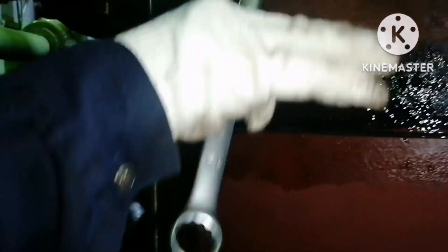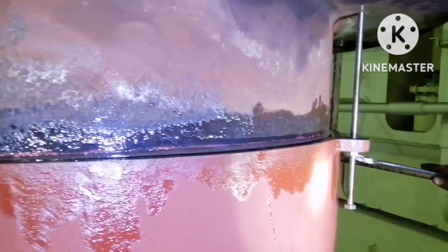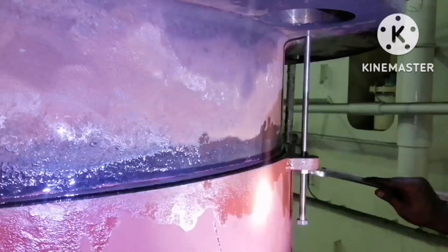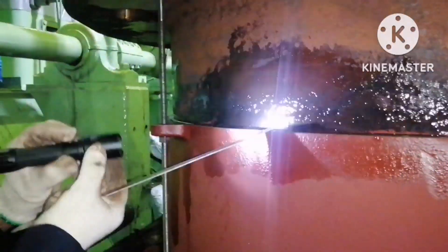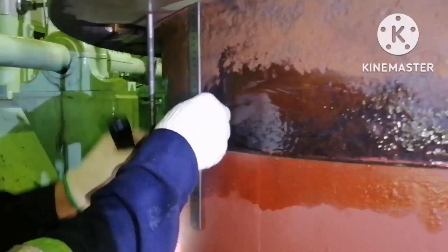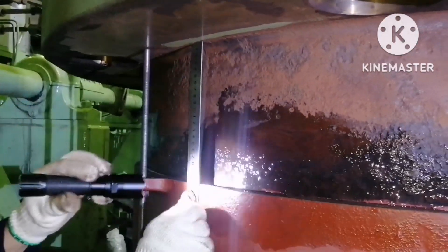The jacket is touching the top portion. This is a very critical stage because the o-ring should not get damaged while we are fitting the jacket in place. Always keep in mind that you must not damage the o-ring while fitting the jacket. If you damage the o-ring, you have to repeat the entire job. Fitting a jacket with the cylinder head is really a hard job, so do it properly the first time.